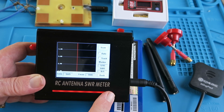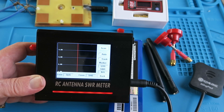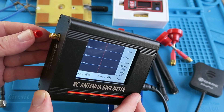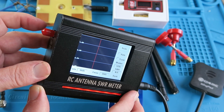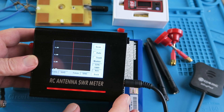It's very important that you don't power the unit up without an antenna attached. We have here a traditional SMA female type connector. Always keep the protective cover on there to stop any dust or crud getting in there. Let's get an antenna attached, and then I'll take you through the two modes.